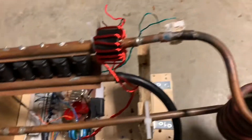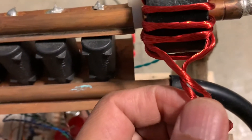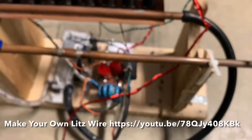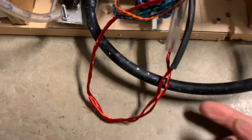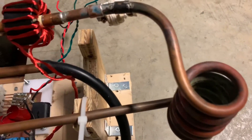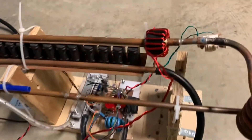But with 14 turns, there's way better energy transfer into this tank circuit. And as you'll notice, this coupling transformer is made of Litz wire — this is actually homemade Litz wire. What Litz wire is, is each individual strand of wire in here is insulated against the adjacent strands. I've got about 100 or so strands in here, and I've actually got a video out on how to make this. Each individual strand is 30 gauge. I wound on 20 to 30 loops and found very poor energy transfer, then slowly started unwinding it — one leg and then the other — so each end would be the same length. That's why I've got so much excess on here. So 14 turns works great.